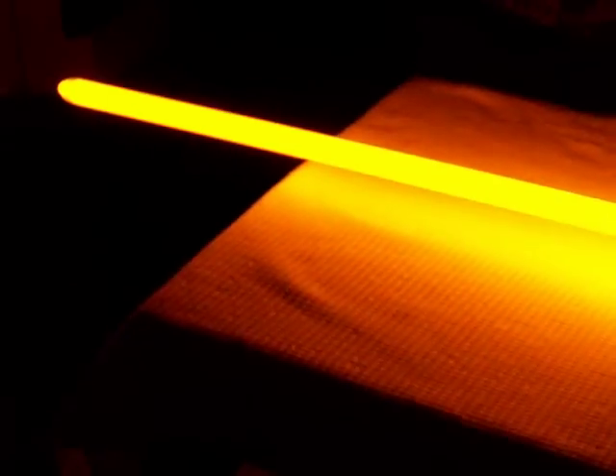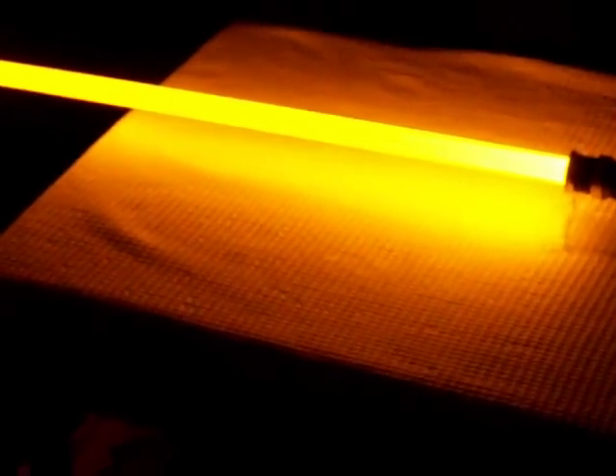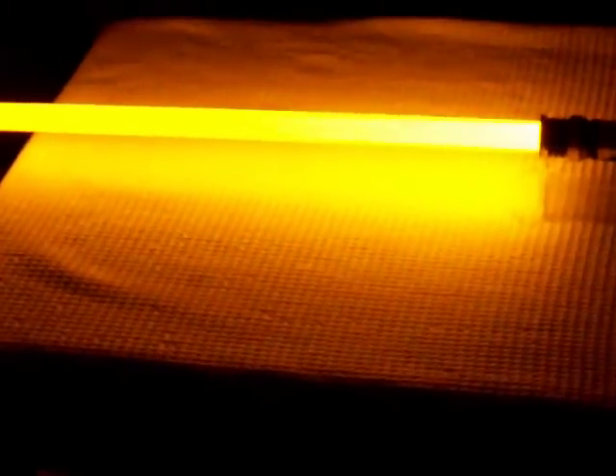You'll notice the blinking accent LED — the Petit Crouton has the ability to sequence and power two accent LEDs from the internal pads. There's that awesome ignition and deep hum. It does have the subtle organic flicker inherent in the Crystal Focus V4 driver, because it shares the same LED driver from Crystal Focus version 4, capable of powering LEDs up to 1.5 amps — perfect for LED engines hungry for that current. The auxiliary switch, just like on a Crystal Focus, gives you access to extra sound effects like a blaster block, and holding it gives you the lock-up or blade-cutting effect. Both sound effects also affect the lighting effects, very similar to the Crystal Focus.